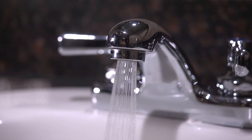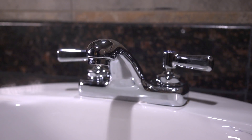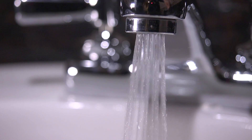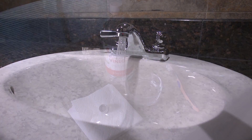To help minimize the risk, flush your faucets used for drinking water daily. If the faucet hasn't been used for a few hours, run the cold water tap for a couple of minutes. This will move water from the water main to your faucet and will lower the amount of lead coming from your plumbing.